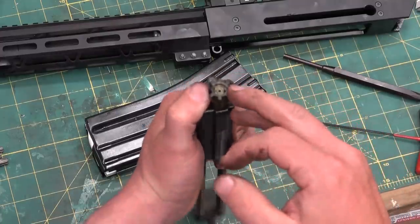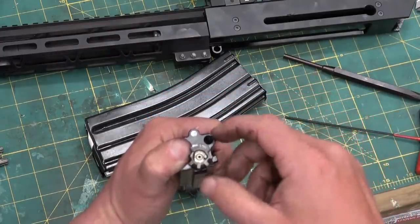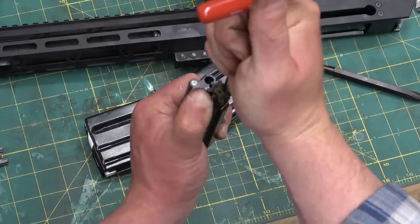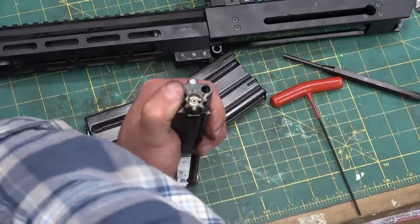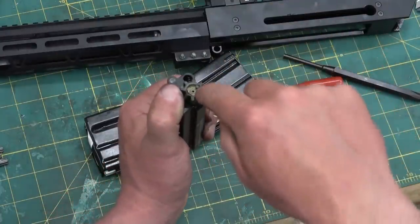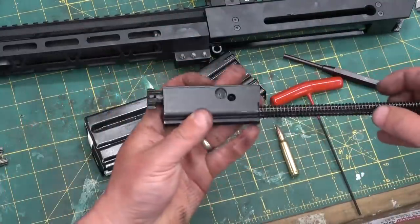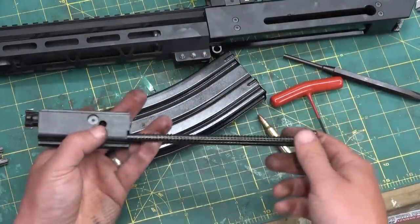Well, the feature you see on the bolt, what you don't see on the early SKS Soviet semi-automatic rifles, is this little piston here, what adds to the ejection effect. So we're hooked in the claw on this little lip here, but it's also wanting to buck this off. This is under spring tension. It's held in place, of course, by everything being locked up. And then when it opens up, this allows that to pop out more easily.